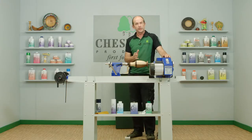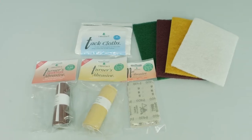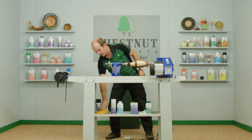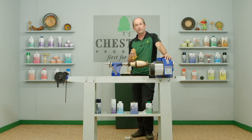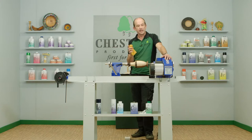There are several different options for sanding the sanding sealer back. On this occasion I'm just going to use an abrasive — usually the last abrasive I used on the timber, in this case the orange nyweb. We'll let the lathe do the work for us. Before we do that, we'll have a quick look under the microscope at a finish that's been sealed with the sanding sealer. You can see how it's sealed the surface, and the white specks — not really visible to the naked eye — are the sanding agent that we're going to remove with the sanding action.